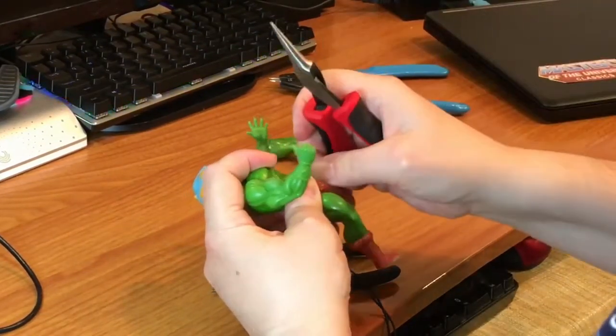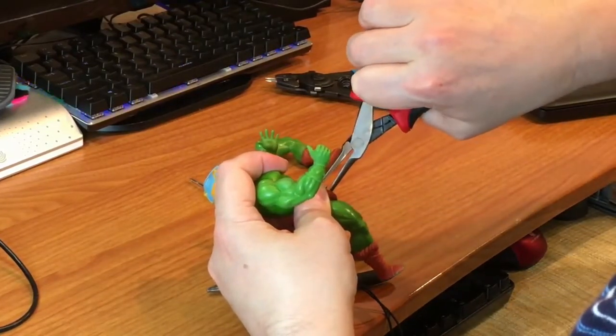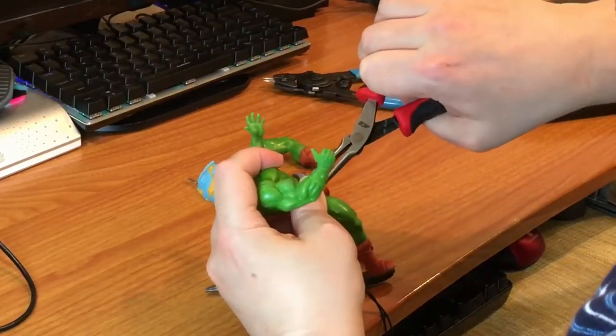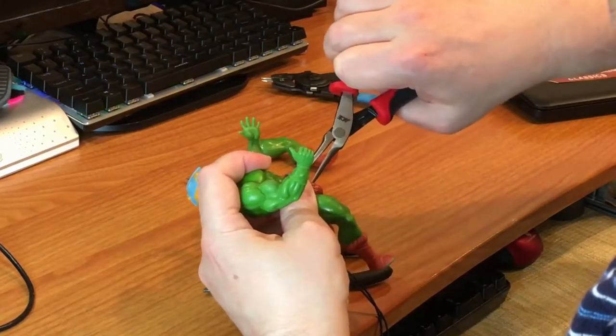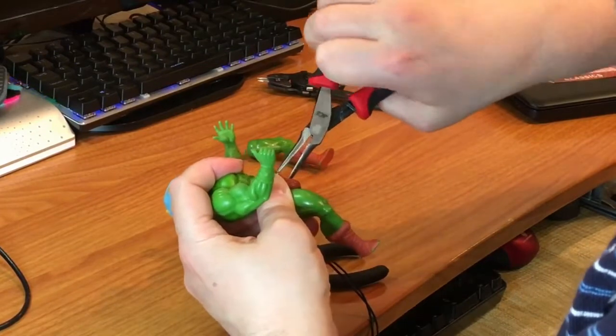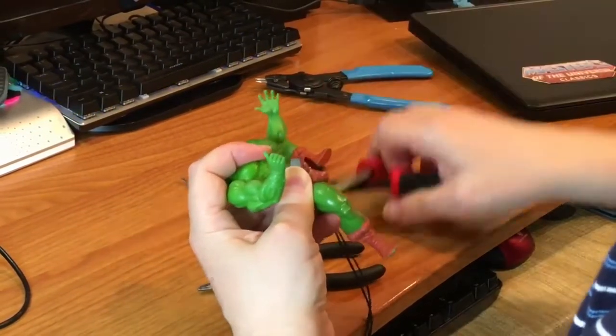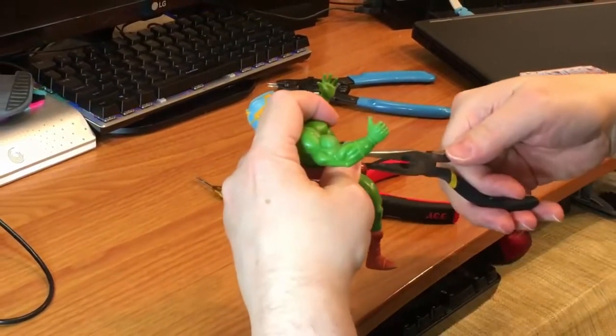Alright, get that screw eye closed. It's a little hard with the non-marring tools because it doesn't grip on there to hang on to it, but again, you don't want to cause any chafing on that screw eye, otherwise later on this is going to be a sharp edge that's going to just cut through that O-ring. So you want to be careful not to cause any extra damage.